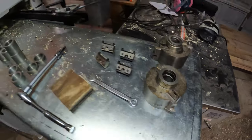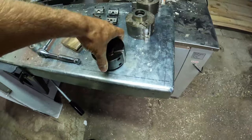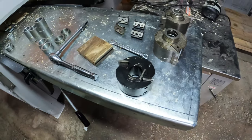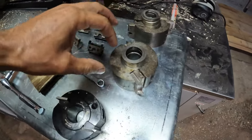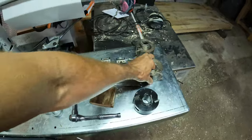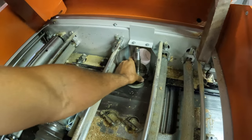If you're starting from scratch, I'll pull out one of these Wood-Mizer heads. Obviously the first step would be to unbolt that, pull that knife out, put in whatever you're cutting with, and then adjust your shims to get the right height for your setup. But I'm kind of jumping ahead because this is a common setup for me and I have a dedicated head for it, so simply shims go in, the head goes in carefully — you don't want to nick those knives against anything.